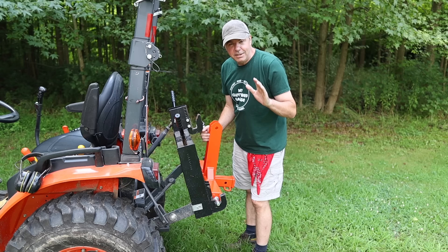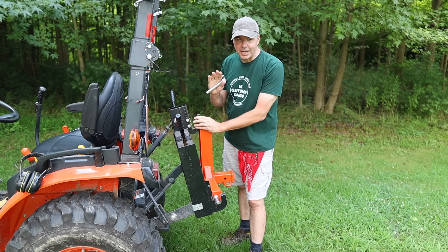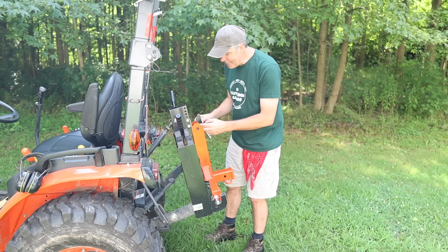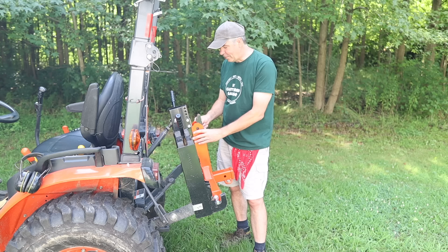This Heavy Hitch is, in fact, heavy. You can see it fits right on the Quick Hitch. But because I cheaped out and bought the Harbor Freight Quick Hitch — if you're familiar with it, the biggest complaint is that the top hook is not sized properly. It's too thick and too close to the bolts, and things just don't fit on there. When I try and place it, I can't lower this top hook — it's at the lowest setting right now, and it needs to go at least a half inch lower. So it's not going to work for me here.